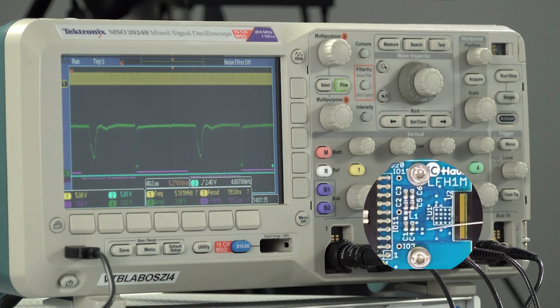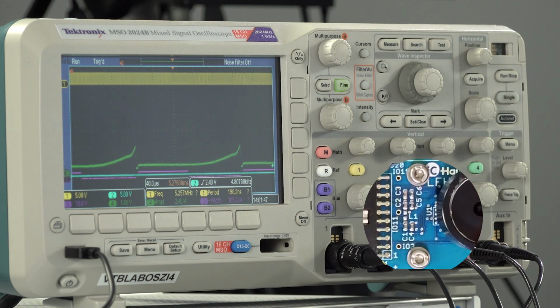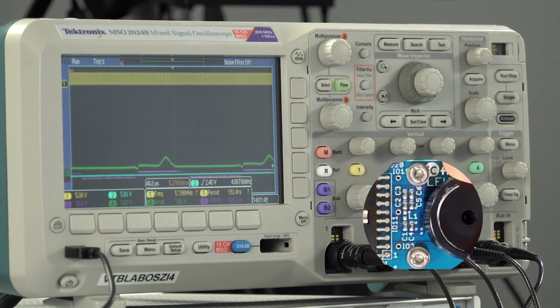And of course, when I move the wire to one end of the sensor, the dip on the scope trace moves to one end of the frame too. This is quite an easy test, but in most applications, a point of light or maybe a line should be detected. I can easily mimic this scenario with this 2 mm pinhole I brought with me, though I now have to be more exact in positioning it. A slit would be easier. Let's see if I can get a signal.